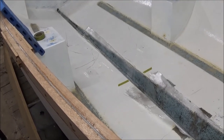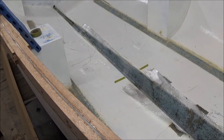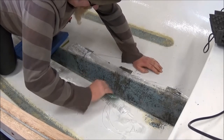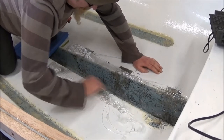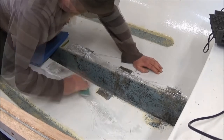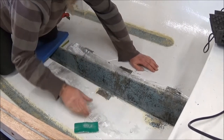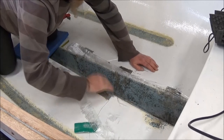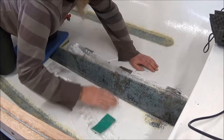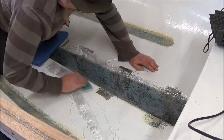It's tightened up the inside of the keel, ready now to turn the boat back over and start chopping up this nice big plank of oak. By doing it this way, you wear through and feather out the edge of the matting where it's been glassed. Where it's not got any glass, it gives a nice smooth transition rather than chopping it off. It just comes away as it wants to.